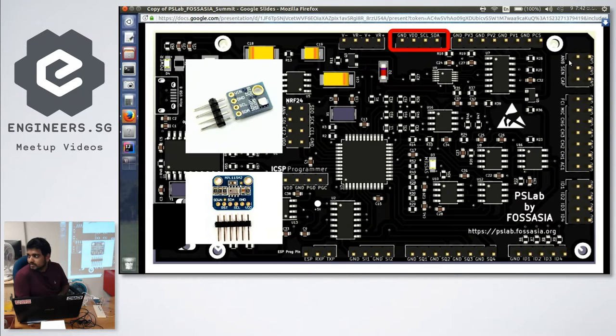What range does it support? It can measure voltages from minus 16 to plus 16. So you can't plug it into the wall socket? No, not AC. Is it just DC or also AC? It can be DC or AC as long as the range is between minus 16 and plus 16. A wall socket we cannot measure, so your AC is not RMS. Wall socket AC is not good.